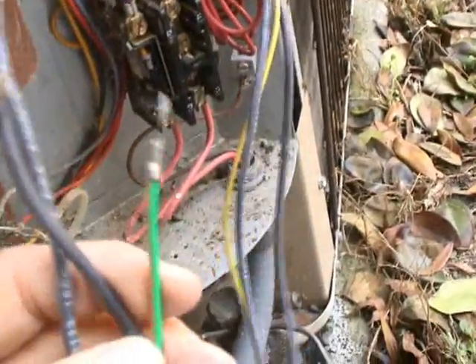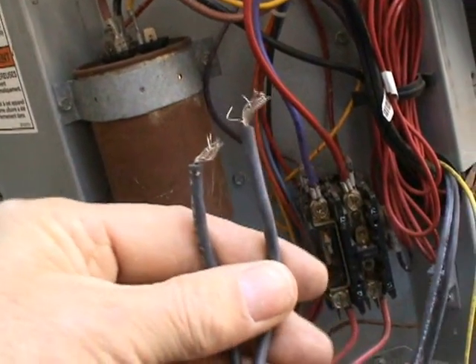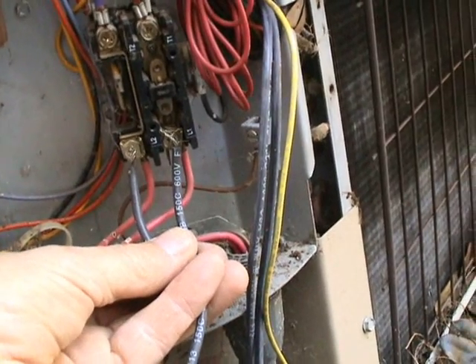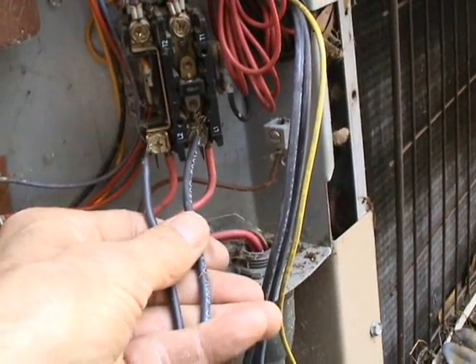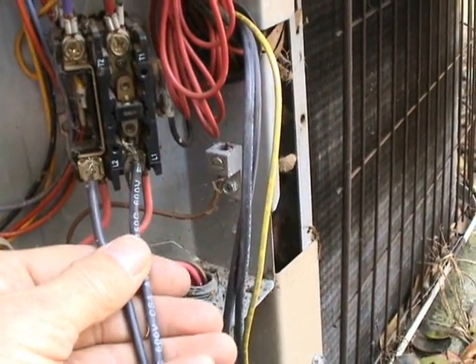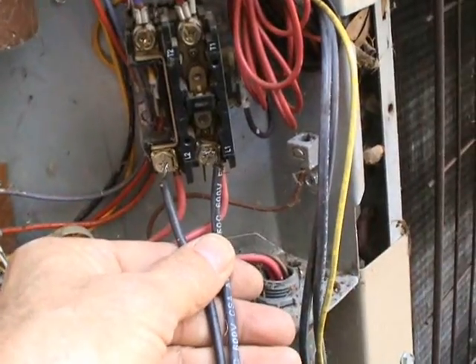So here we are at the control panel and I have the wires. This green wire right here will be connected to ground someplace. What we have here are the little wires that get connected to 240 volts, so I'll just connect them right here — straight direct, so they're lit all the time. Usually I prefer to use something like an auxiliary contact connected to the side of a contactor, but that's usually for commercial use. In this case it's residential use, and so I'll just connect it directly hot so that it'll run 24/7 on the compressor.